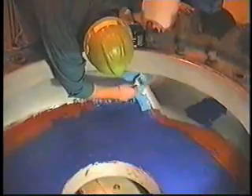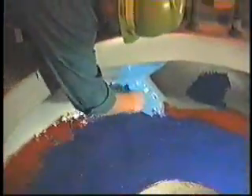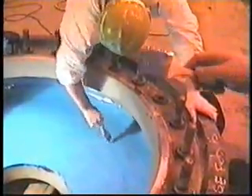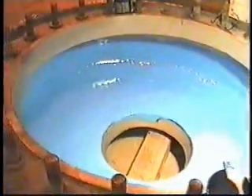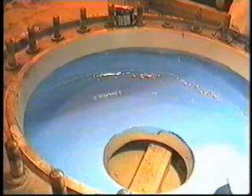While the ceramic repair putty is still tacky to the touch, apply the final coating of brushable ceramic in a 15 to 20 mil coating. This coat should cover the entire pump chamber so there is no leading edge that can be attacked by the material being pumped. The light blue brushable ceramic was used for the final coat. Applying it over the red primer coat and the dark blue ceramic repair putty makes clear when 100% coverage has been reached, and it makes future visual inspection for wear easy to do. If you see red, it is time to resurface the pump as a preventative maintenance measure. This coat provides a monolithic seamless coating. The low coefficient of friction finish enhances pump performance and protects the pump from abrasive and chemical attack.